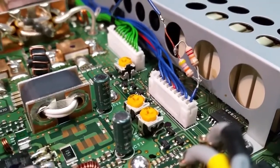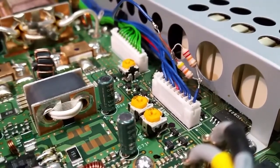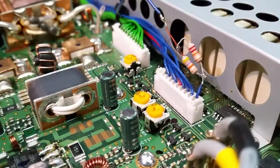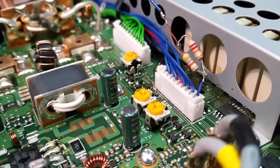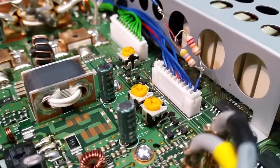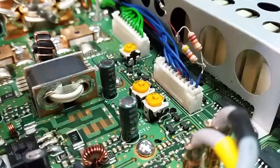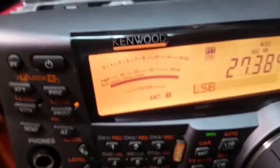This little trick right here — this little line — is the HF ALC. I'm hoping it's as easy back there for the VHF, but I'll have to find out and do some more looking to find where the VHF and UHF ALC lines are. They're going to be about the same thing and probably the same exact value. If you don't get the resistor value right, you lose the meter, because it's sampling the RF off of there and reporting it back to the CPU, which calculates your modulation versus power and swings the ALC accordingly.